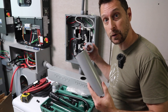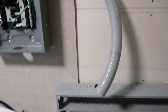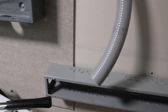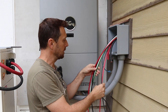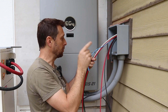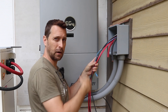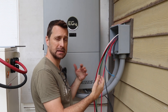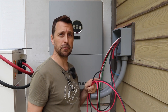Let's get this box up on the wall and run our conduit through the wall. We're making good progress — almost everything is disconnected from our 12,000 XP and our sub-panel. We've got most of the conduit run, but the most challenging part is getting everything measured out, the holes cut correctly, and things punched out correctly — that takes much longer than all of the wiring itself. We've got our AC wires coming out: line one, line two, neutral, and ground. We've got our communication wire from our batteries, one of our solar PV strings, and the battery cables coming out. We have a few different pieces of conduit coming into different knockouts on the bottom of the Flex Boss to give us space and bring the wires into the proper position.